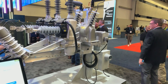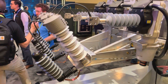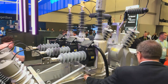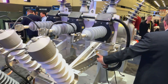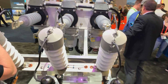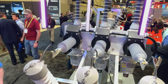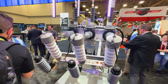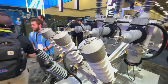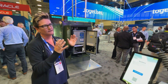Shifting over here a little to the left, this is our Viper ST. This is a very successful recloser line and we have recently enhanced the ratings — it's up to 170 kV BIL. What you can see is we're showing an application that has all the CTs and our sensor products on it, so it's kind of everything in one. Not all customers need everything you see here, but we're trying to display all of the site readiness that we can create with our Viper on an overhead line.